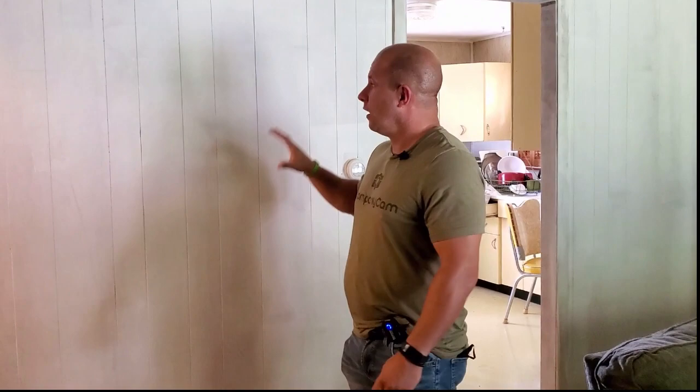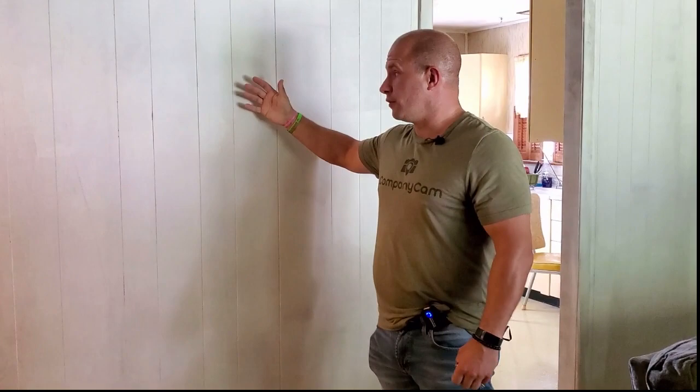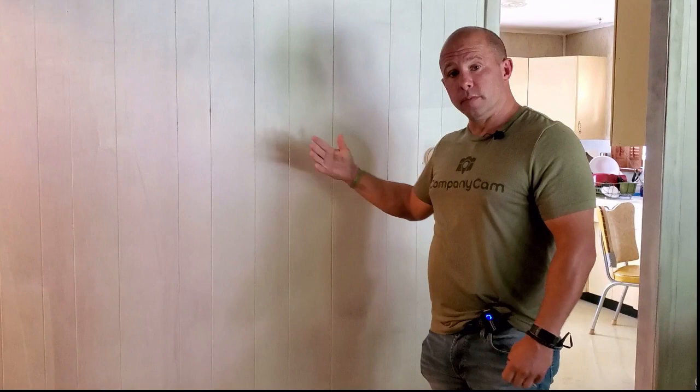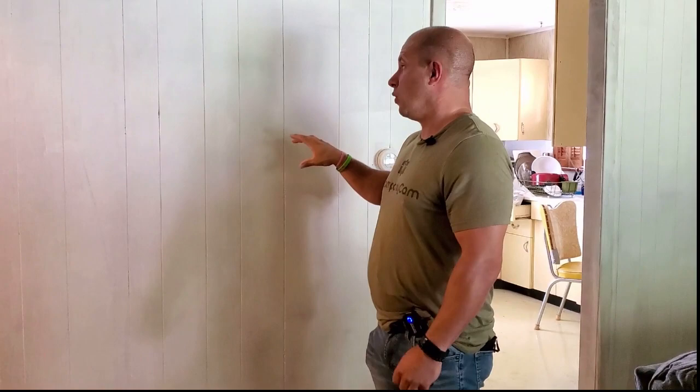This is Ryan. We're over here at a residential project — this is actually for a friend of mine. This was the paneling I showed you yesterday in a video. The issue we always have with paneling is that it's slick — there's nothing to penetrate, nothing to absorb. So we want a good adhesion primer; that's my first worry. Second worry: they smoked in the house, so you can smell some nicotine.